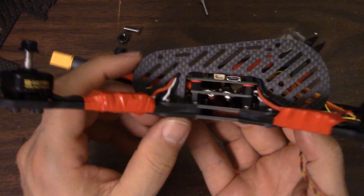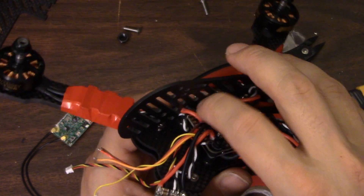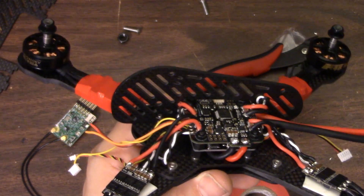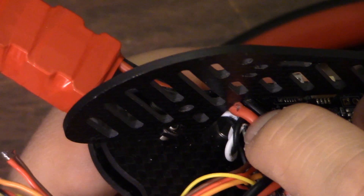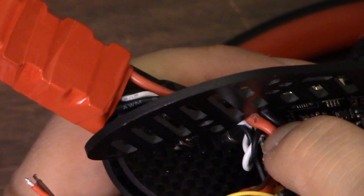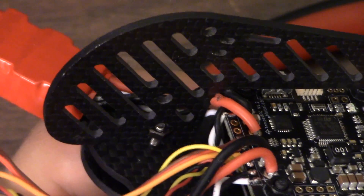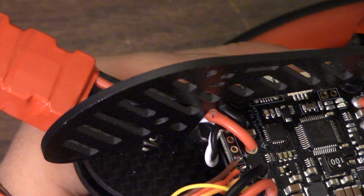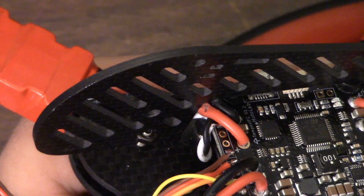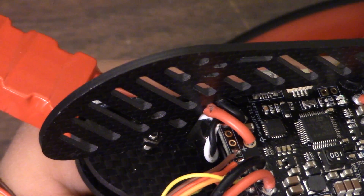The final straw was that while I was trying to make this situation better, I tore the insulation on a wire - and that's a no-go. You can't have broken insulation on your ESC wire. So I can't finish this build until I get some more wire to replace it, at which point I may as well just run the wire correctly to begin with.